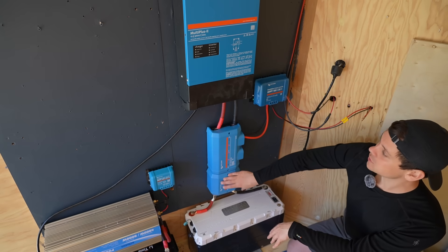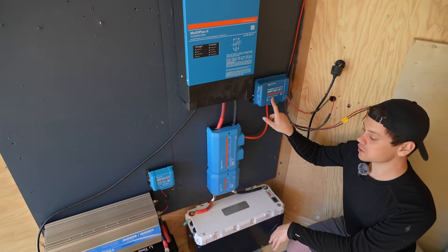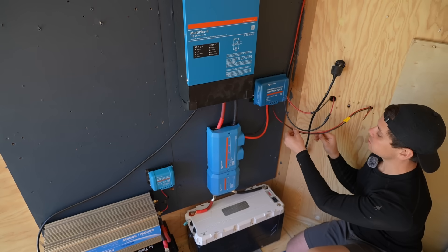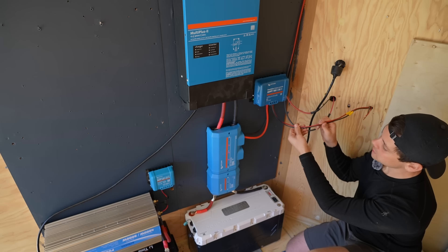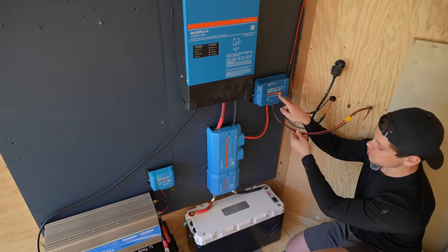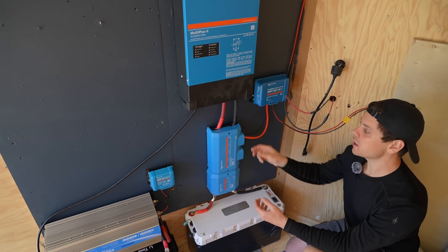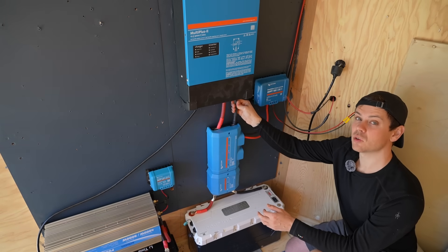You can get rid of all of that and just connect the inverter straight to the battery, then throw the solar charge controller on there somewhere. Some people like it simple like the budget system, and some people want all the functionality. The solar charge controller is connected to some solar panels that are outside — we have a positive and a negative. As long as the voltage of the solar array is below 100 volts, you can safely connect it to the solar charge controller. Also make sure you have a 12-volt inverter if you're using a 12-volt battery. I have a video on how to make these cables, and if you don't want to make the cables, you can buy them ready-made.